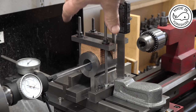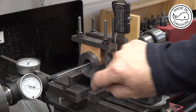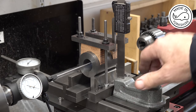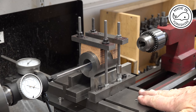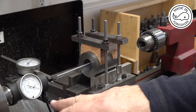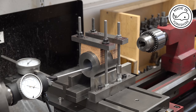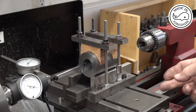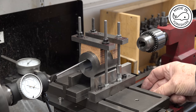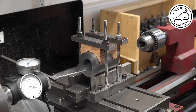So what I've done is I've used some parallels here which are nice and rock solid, bolted it down like that, and I've adjusted the cross slide so I've got it as close as I can really with this gauge — just slightly out but I think it will be okay. Having adjusted the cross slide I've then locked the cross slide in place using the locking screws on the side. So with that in mind I think we're ready to have a go.